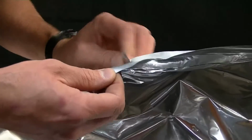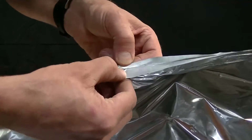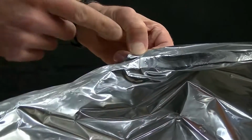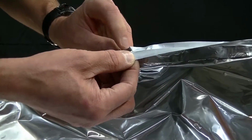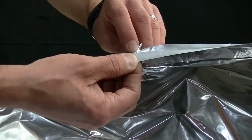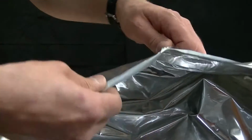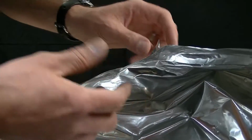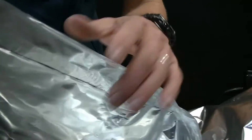Of course, there's a flap of film that folds up, but if you look at that, you can see that there's a good seal, in the wrinkled area, right up to the point where all the layers meet, and we've got a good durable bond in that area where there might otherwise be a pinhole leak. We don't get that with the HS-BII because we have the point-on-point compression of the compression rollers. And then we finish our seal across the bag.